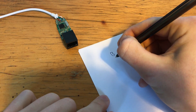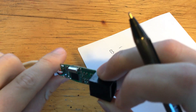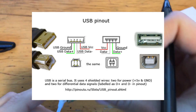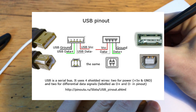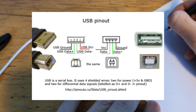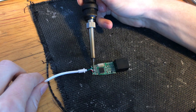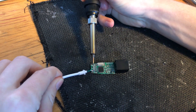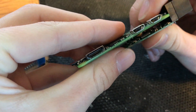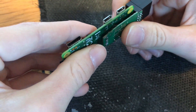It's standard practice for the red wire to be positive, the black wire to be negative, the green to be data plus, and the white to be data minus. However, on cheap Chinese products like this you just can't be sure, so it's best to check so you don't mess anything up. One thing I can be sure of is the order of lines on the plug itself, so by checking for continuity between each of the terminals on the plug and the device, I can figure out which is which. By trying each of the lines I confirmed they were following best practice and each color was what I thought it was. So now I know what's what, I can go ahead and desolder all those wires. The idea is I'm going to take that adapter, hot glue it to the bottom of the Pi, and then solder up the corresponding terminals from the Pi to the adapter, so it should act just like it would be if it was plugged into that micro USB port directly.